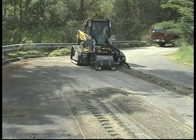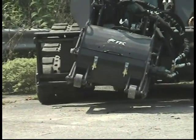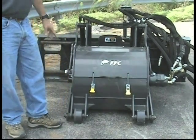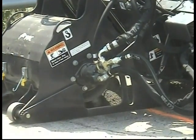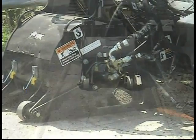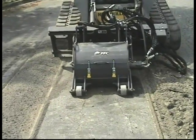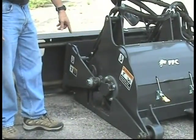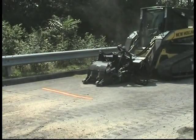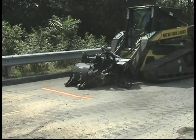This cold planer is a top center pivot design equipped with skids and wheels to meet certain bed specs. It has a motor planetary gearbox driveline system. It allows more torque than any direct drive unit available out there. It's supported on the opposite side with a 2.5-inch bearing. That allows even down pressure and gives support against it. It has a set of rear cylinders that act as depth cylinders.